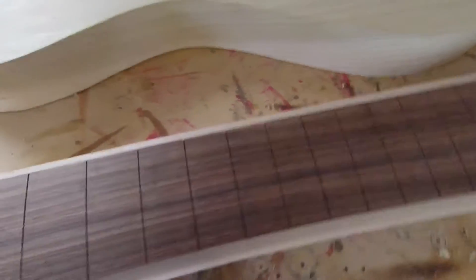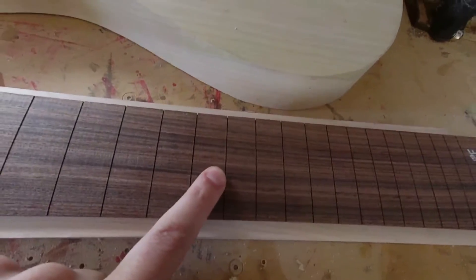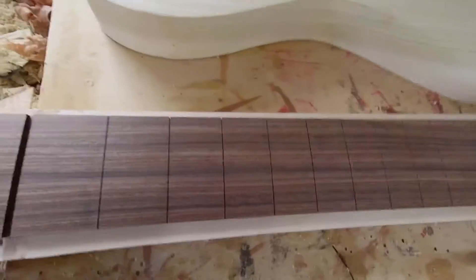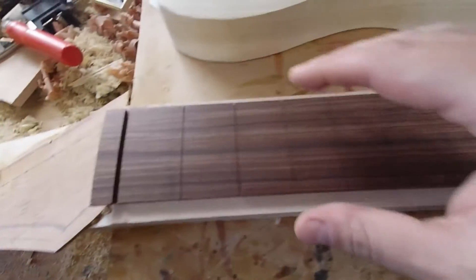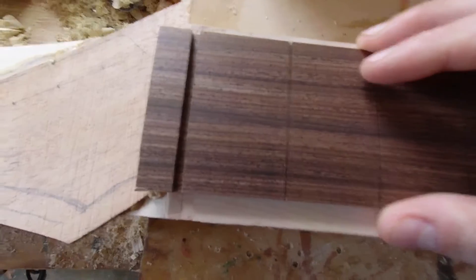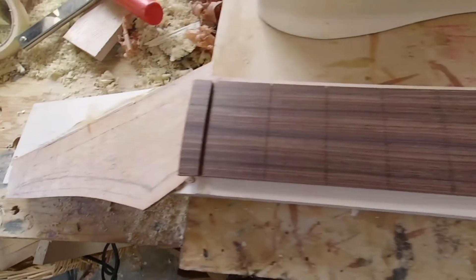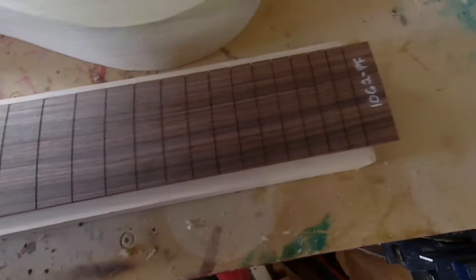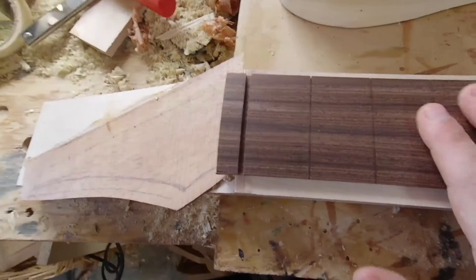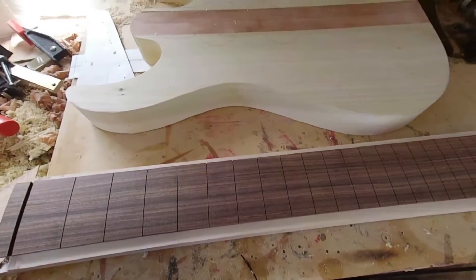We're going to be doing 24 frets, of course. I might do a single inlay on the 12th fret — probably not going to touch the rest of them, simply because I think it looks cool with just one inlay. We're going to cut this piece off right here, and that is the nut line. This is a 25.5 inch scale — that's what I decided on. It should be fun; that's going to look really, really good. I'm actually very excited for this. What we got here is basically where we're going to put it — I did chop off that little piece at the end, lining up with the nut. That's looking really good. Now we'll go to the bandsaw and cut the profile of the neck.